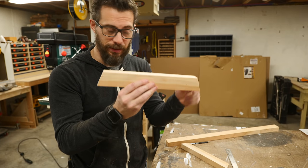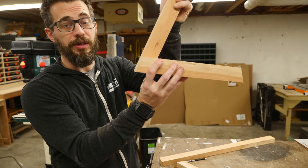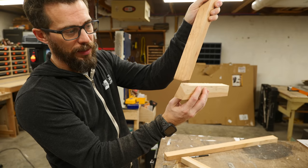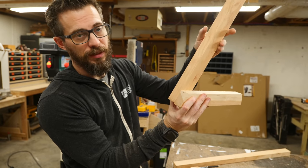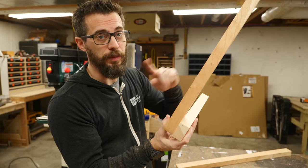I cut the bottom pieces with the same angle so that these pieces will match up right there. Now these are going to be connected with a half lap, so I'm going to put them on the same plane — I'll cut away this section of one and the opposite section of the bottom, and then they should fit together and all stay on the same plane. That's the idea for all three of these pieces, so I'm going to get everything cut and then we'll work on the half laps.